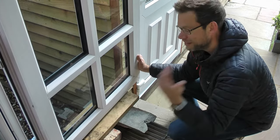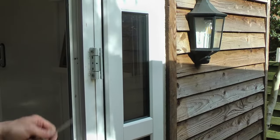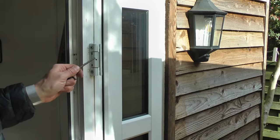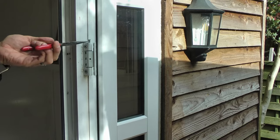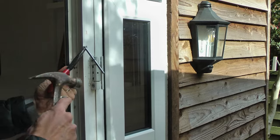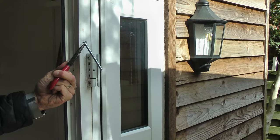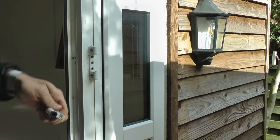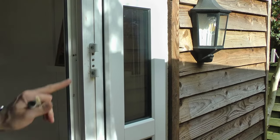I'm going to attach and pin the door back to this building - you'll have to makeshift this with whatever your scenario. When the door drops it's caught by this so it won't fall. I needed the cameraman's help to lift the door out. The door's off now - I just wanted to show you the grub screw I removed. You will not remove the center pin without that grub screw removed first. Pliers are the perfect tool to get in through that door hinge and pull this through. There's a little notch in that pin which is where the grub screw holds it in place for security.